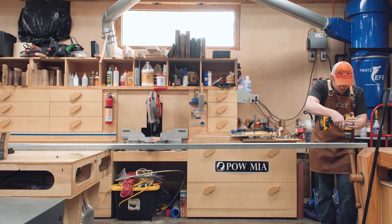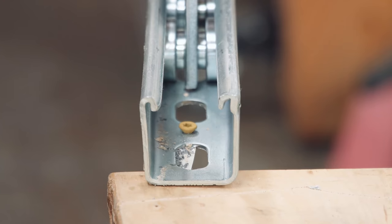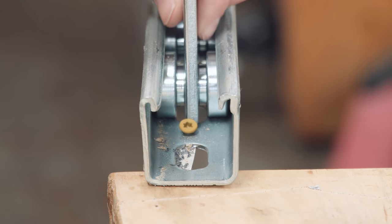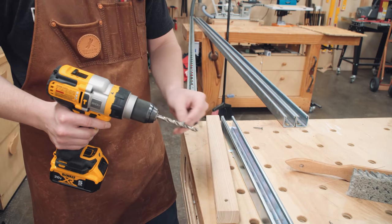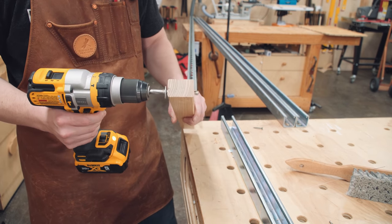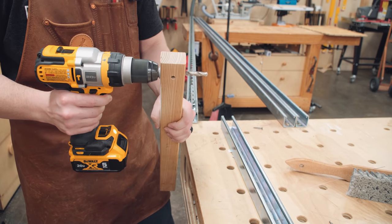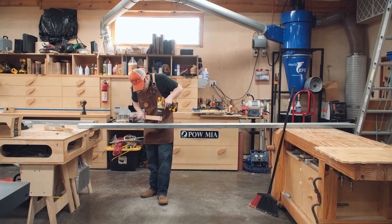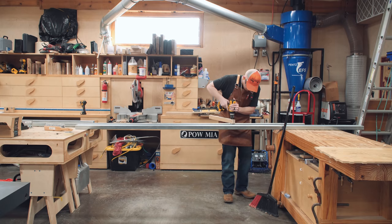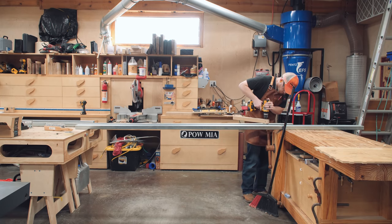With the design done and the materials in-house, I started the build by drilling a bunch of small holes for mounting screws. As you can see with the single hole, the screw heads interfere with the travel of the trolley blocks. The solution is to cut a countersink for each of the holes, and this will allow the screw head to sit a little bit lower. To prevent going too deep with the larger drill bit that I used, I used a washer and a block of wood as a depth stop. This worked really well, but I did have to come back after the fact and make a few of these holes a little bit deeper once everything was installed.